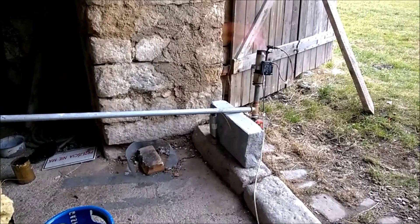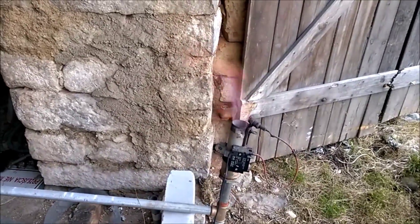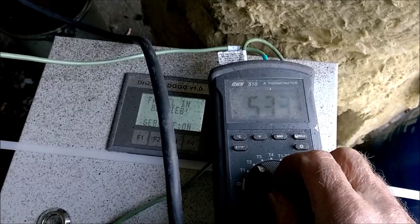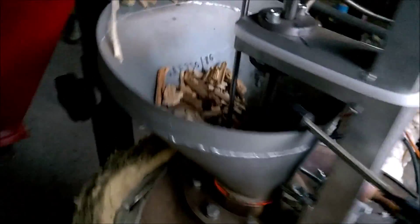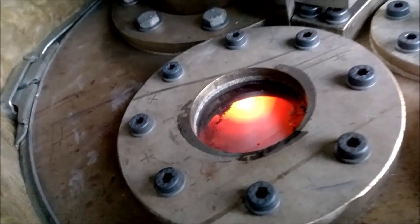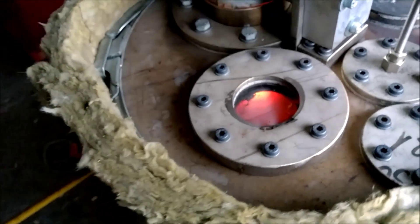We are now 5 minutes on our way. Sustainable flare after 1 minute 14 seconds. This is an unfiltered flare of a cold gasifier — at this moment the gasifier has a temperature of 23 degrees Celsius and 529 inside the fire. You can see the fire tube getting red hot inside the gasifier, and it's still an unfiltered flare.